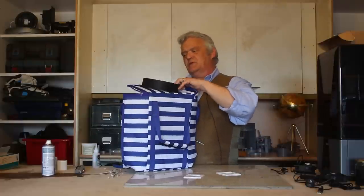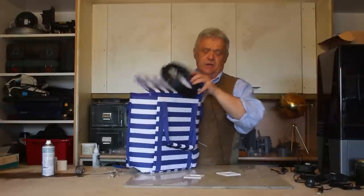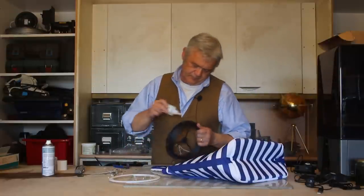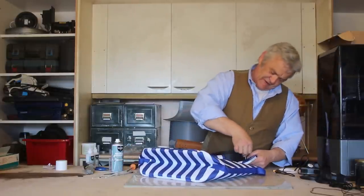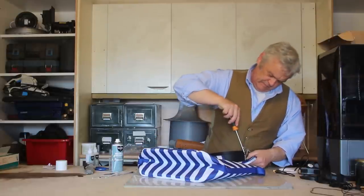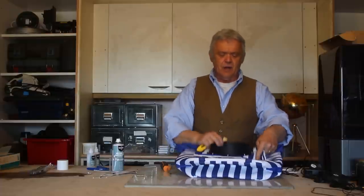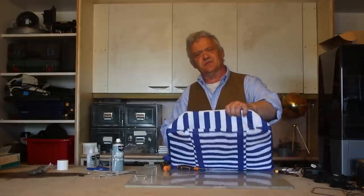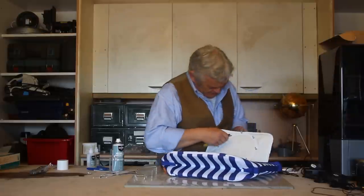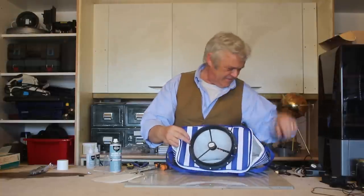The parts all have holes in them, so we're going to puncture through and bolt on the retaining ring on the back with M4 bolts — there are eight of them — then slice out the cloth. The motor is already spot-glued in place, and because the wire has to get trapped there, be careful not to slice the wire when you cut through.